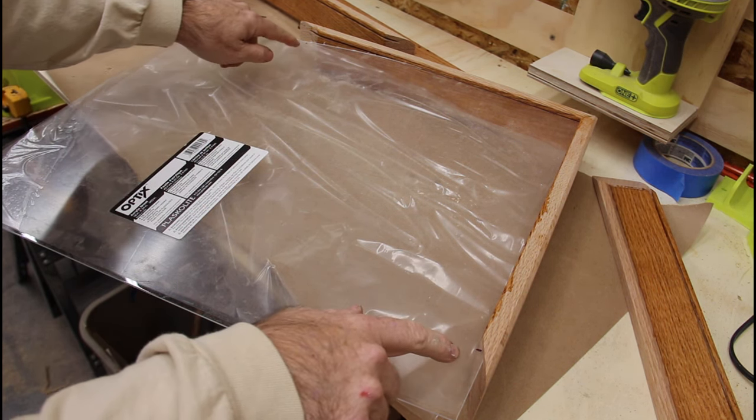Let's get these under glue. So that was in the clamps overnight and it looks pretty good. Got a little glue residue here. This joint was really good. This joint's a little loose — I'm going to try some techniques of rolling that edge over, and then I'll probably have to put a little bit of filler in here. Then I'm going to sand the outsides and do the oil coat on the outsides as well.